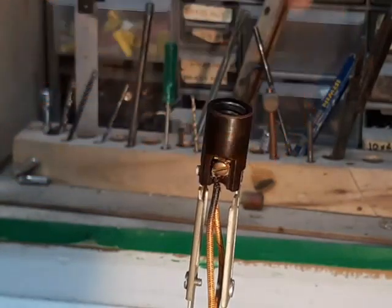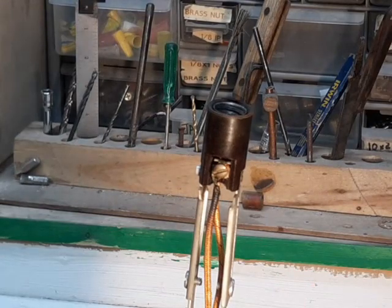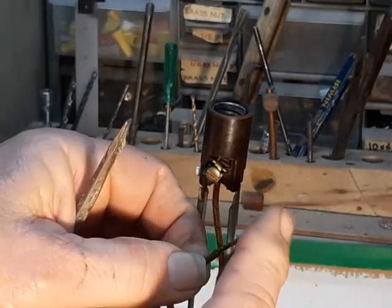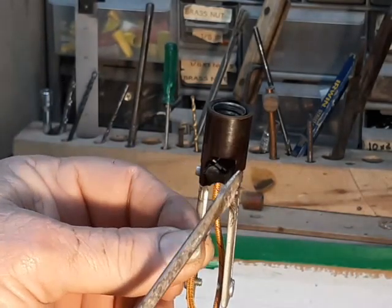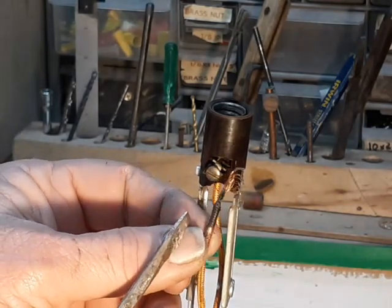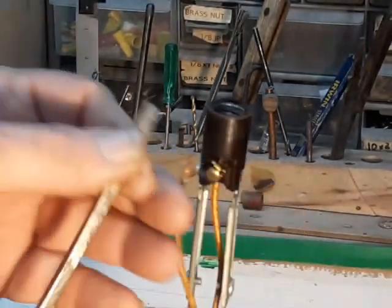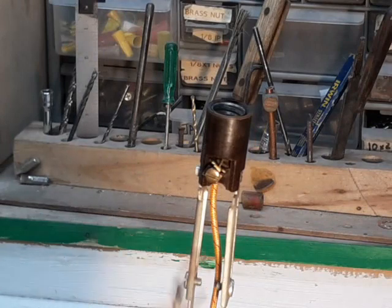I found something interesting — this burned wire right here. The main reason for that is because when they put this together, this wire was not properly installed. These strands like that make it really very difficult to get a wire tight under a screw when it strands like that, and not very likely to stay tight for very long. Loose connections get hot, the heat creates this burn mark, and in this case I think it's actually damaged the socket. So we're going to see how to deal with that so this kind of thing doesn't happen.